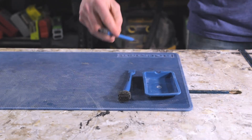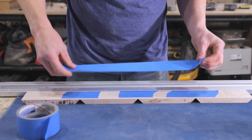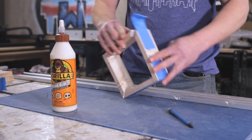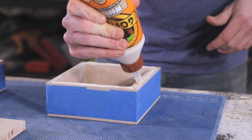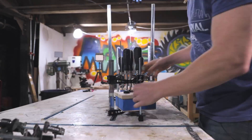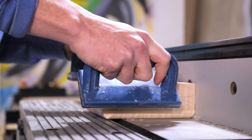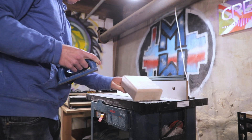The base is about as simple as you can get — just a box with an open back. The glue-up went as usual and as smoothly as glue-ups go. I intentionally cut the top of the box bigger than it needed to be so that I could come back after the glue-up and use a flush trim router bit to cut down the top and make it perfectly even with the sides. After flushing it up, I took the box to the router table and used a round-over bit on the top and bottom edges, just to give it a touch of mid-century modern style.